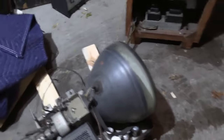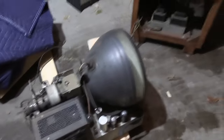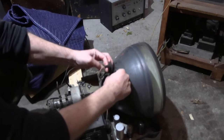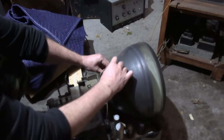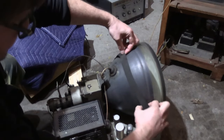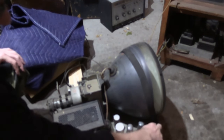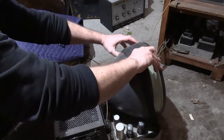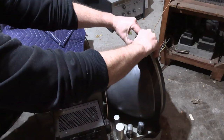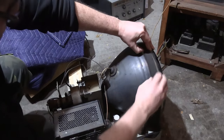You might see this has a D on it — this is a D revision, a D on the focus coil. And here is that strap I was talking about that slipped down. Somebody commented: why'd you transport it with the strap slipped off? I didn't notice it slipped off. It's a canvas strap that goes down, attached on either side with two quarter-inch screws — you can loosen those and the strap becomes loose, then tighten it back down. Underneath are rubber shock mounts that have shrunk over time, which allowed the band to loosen up and come off.